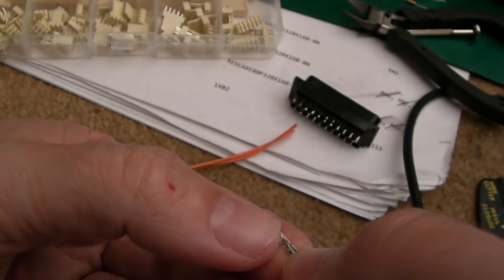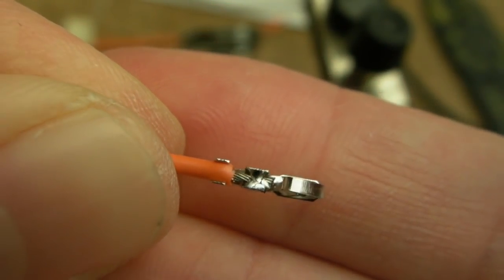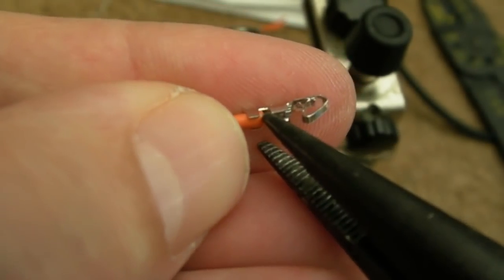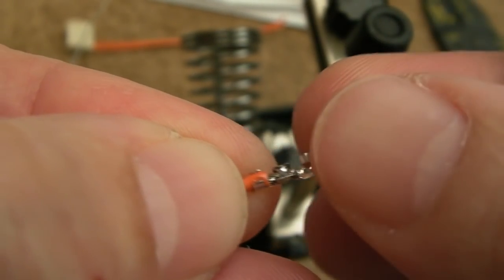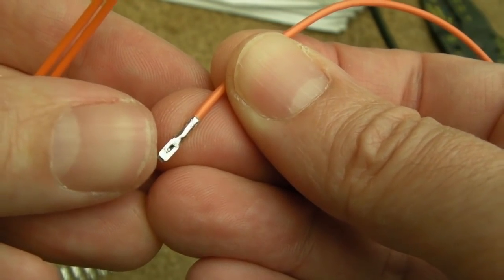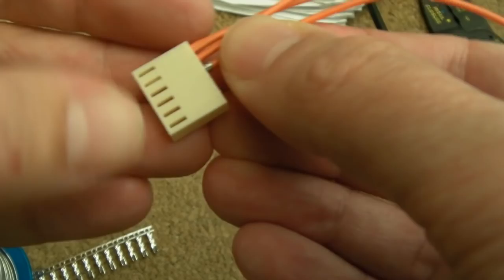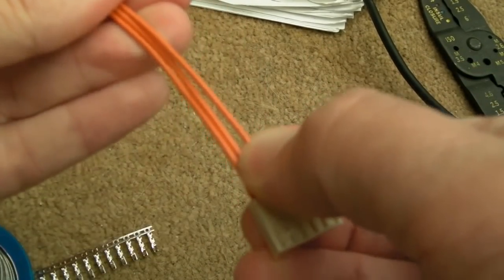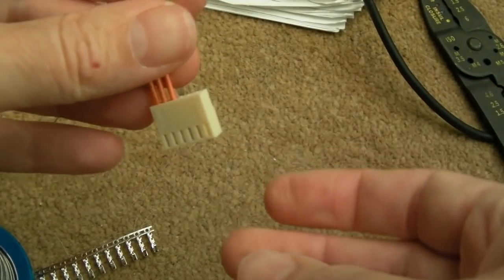The spades stick out like that, with the bottom of the connector over the top of the sheath - you can see the plastic covering - then just solder that centre point down. On macro you can see the wire is in the centrepiece and soldered. You're supposed to crimp those two things but I've found crimping is generally unreliable. Then squeeze these wings together just to grip the cable. The final step is getting it the right way up where the little metal tab slots in with a click - that's not coming back out. Nothing tidy about this - I'm not even using different coloured cables. It's just a temporary adapter that's going to plug onto the board and provide me with a SCART socket.